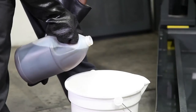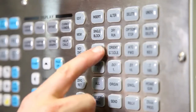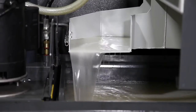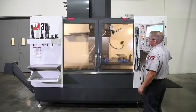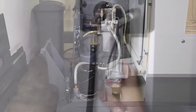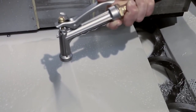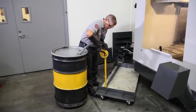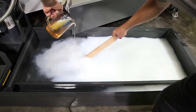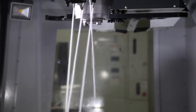Then you should prepare a high alkaline cleaner and pump it through the system to kill the bacteria that remains throughout the coolant plumbing. These high alkaline cleaners are usually available from your coolant supplier, typically mixed with water at a low concentration and run through the system for a few hours. Run all the coolant pumps on the machine and be sure to empty all areas of your coolant system where contaminated coolant may accumulate, like the washdown hose. When finished, drain the cleaner and follow it up with a rinse using a partial batch of 2% coolant to completely remove the cleaning solution. Now you're ready to start a new batch of coolant.